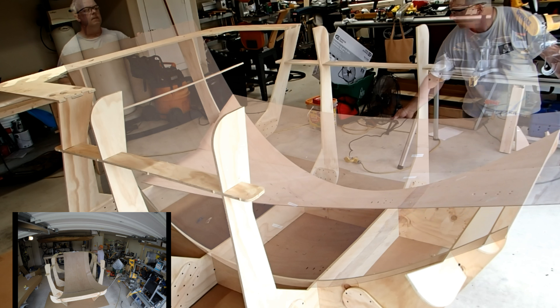Four: some copper stitches just aren't up to the task of pulling the wood into position. A steel stitch is stronger. If you've broken a couple of stitches in a location where you removed the stitches before you used any epoxy, you can happily use some steel wire. Just don't use the steel wire where you have to leave a stitch buried inside a fillet — those stitches have to be trimmed off on the outside and then sanded flush. One place you end up doing this is around the bulkhead. The copper stitch can easily be trimmed and sanded flush with the wood, but a steel stitch will be much harder than the surrounding wood and you will end up sanding wood and not stitch.